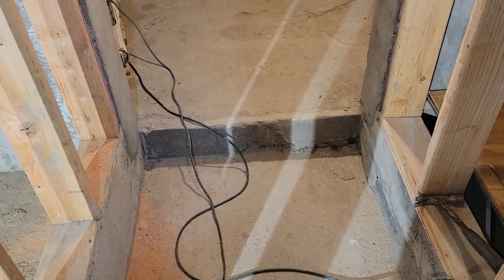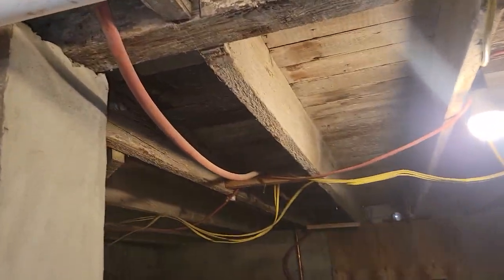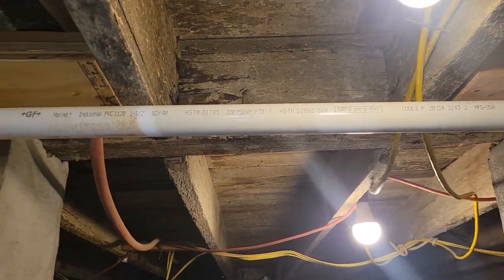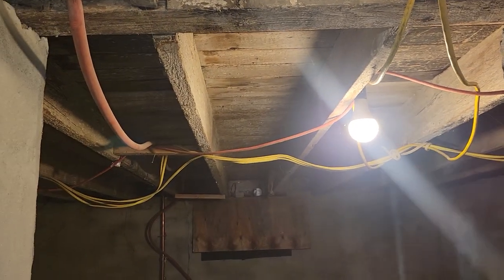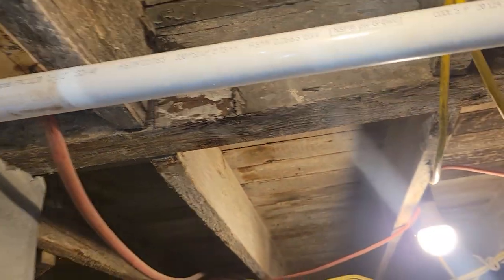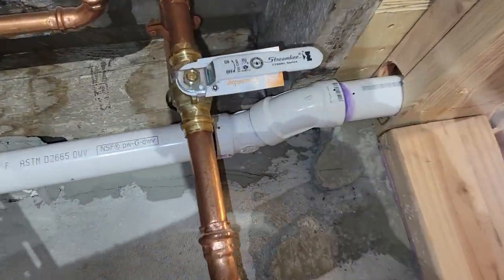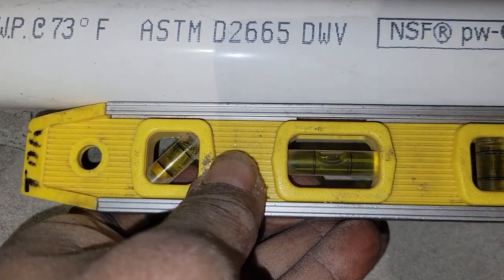The idea was there's a step up here of eight inches. I could have gone through the wall first and then crossed back, but we had more height on this side. When they do the ceiling — if they box it — as you step up you'll miss it; you have more height in the doorway. So I did it after the doorway so you have more height as you step up. It goes around and right about here is where I reached the peak.